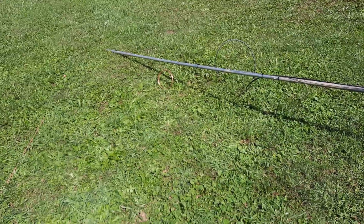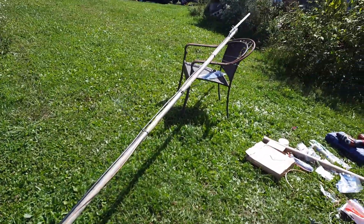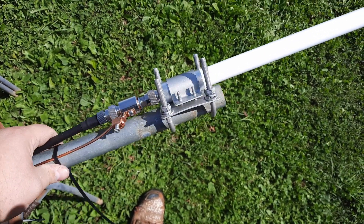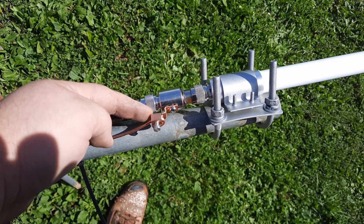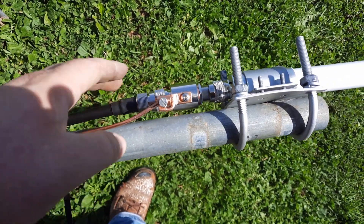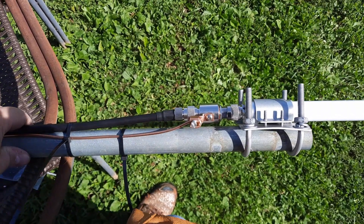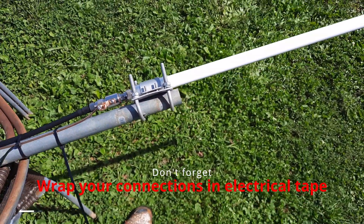We've got the antenna put together, laying on the chair. We've got our extra copper wire — I won't cut that until the antenna is up — and the cable that runs down, with everything zip-tied. At the very top we've got our 8 dBi rack antenna installed with the mounting bracket clamped around the top pole. We've got the surge protector, and the cable hooked in. I took the copper wire, looped it through the grounding bracket, and tightened the screw so that even if the screw comes out, the copper stays attached. The copper wire runs all the way down the pole.